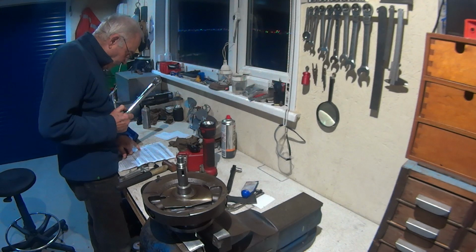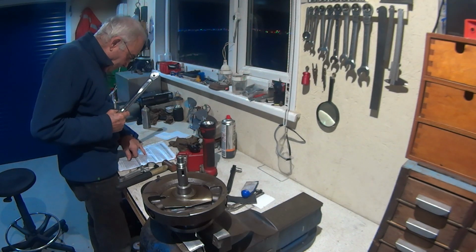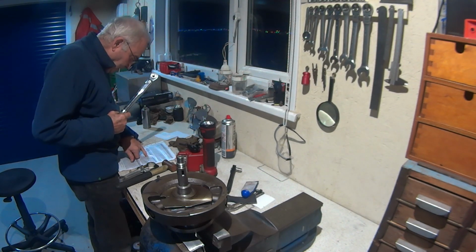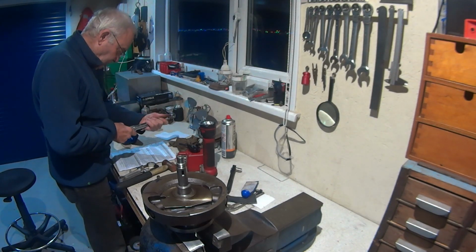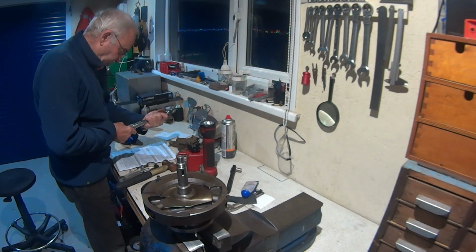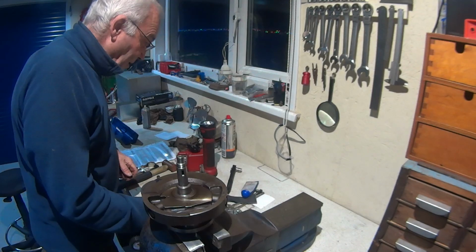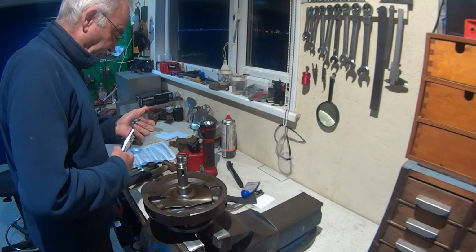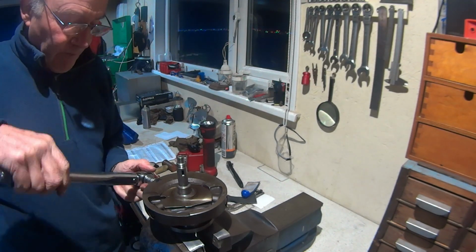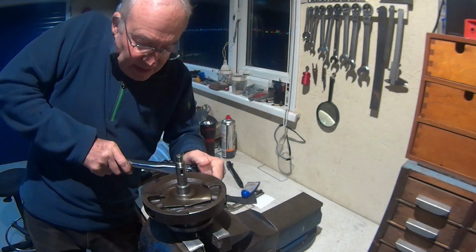3/8 UNF is going to be 31.9 foot-pounds. So there's 32 foot-pounds, and we're on imperial, obviously, sockets, because it's a UNF, half-inch, 3/8, but a half-inch head, like I say. And just progressively do it.